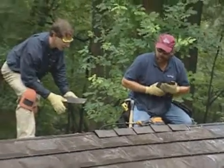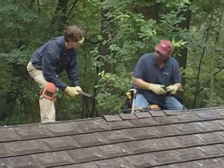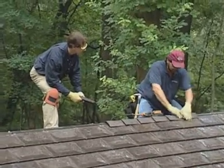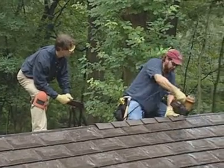Butch, how do you keep your ridge cap straight? You just run it straight to the peak of the roof. Hip cap, you're going to want to snap a line. Ridge cap, they stay straight by themselves. Just follow the peak.